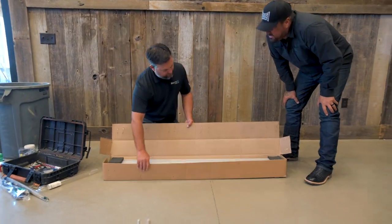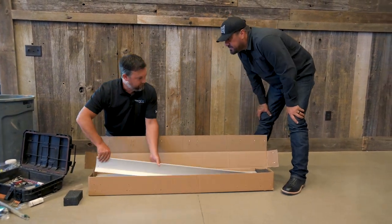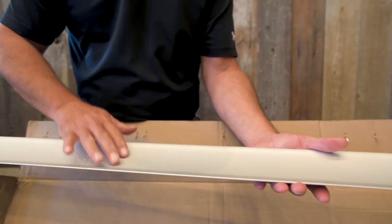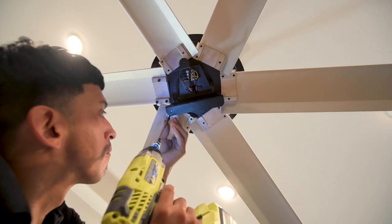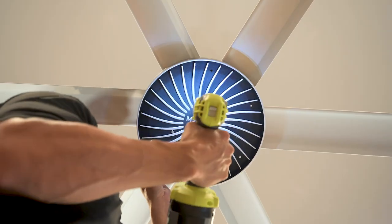So these are our blades for the 370. It is aircraft aluminum 6063 metal, and we anodize all of our blades. Not everyone in the industry does it. We anodize them, and the reason why we do that is it creates a harder surface. It's not your porous metal, and dust — it still sticks to it, but not as much. You don't have to clean our blades as much.